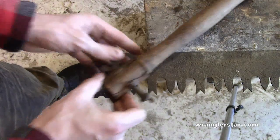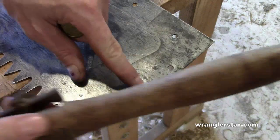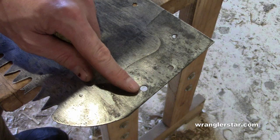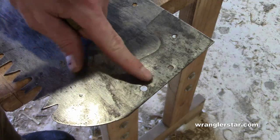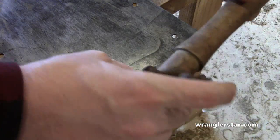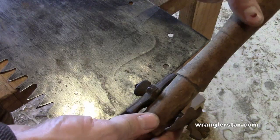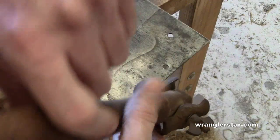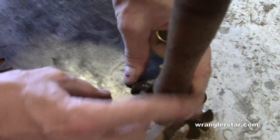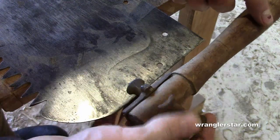Let's see if the pin handle would work as an option for Henrietta's new handle. You can see the three holes — these were for the original D-handle and they were too small; they wouldn't fit any of the pins, so I had to drill them out to crosscut saw size. And you wouldn't believe how hard the steel is — I fried three of my best drill bits trying to get through there and never could. I ended up having to file the hole out. The pin is designed to go into a larger hole, so with this filed out it would go in, the groove lines up the back of the saw, and tightening it down would be an option. It's reversible — you can handle from the top or spin it around for the bottom. One disadvantage though: you cannot orient it horizontally the way you can with the Northwest style of handles. This would work, but I think we could do better.